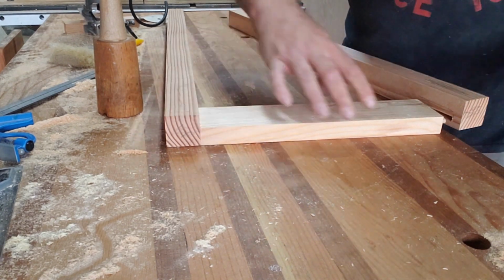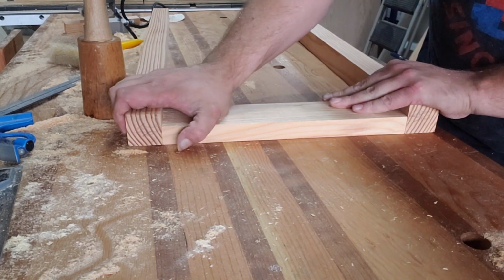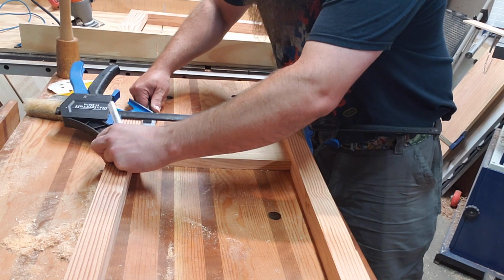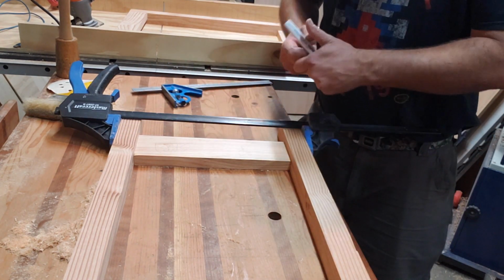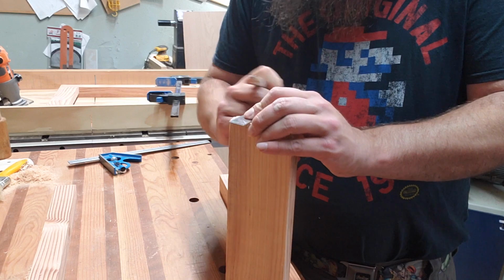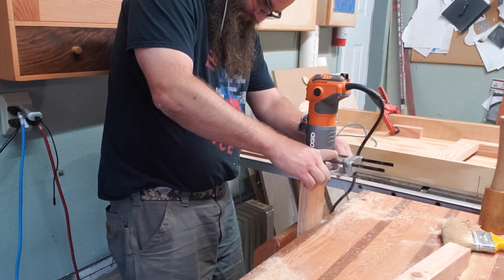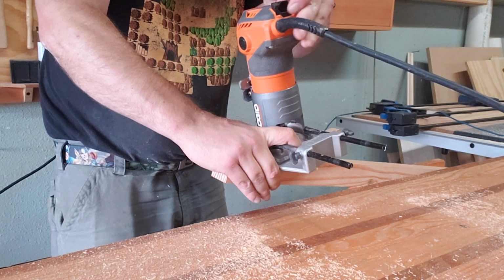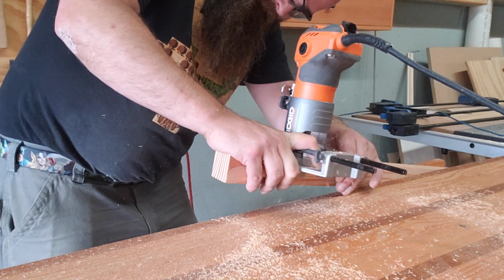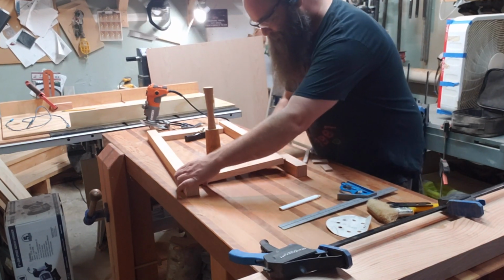And then these are the side assemblies again. So put those tenons in the mortises, attach the top one, and then I can measure up from the bottom of the legs with a combination square that remains set through the entire process. I want to say about 2.5 inches up from the bottom, give or take, because I wanted to have about a 2-inch taper on the bottom of the legs, and then I can square those lines across and do exactly the same thing, loose mortise and tenons. Here it is going into the leg, which I unfortunately had to put on a little bit of an angle in my leg vise in order to get my fence on my router to ride nicely. And then we can do the first of many dry assemblies.